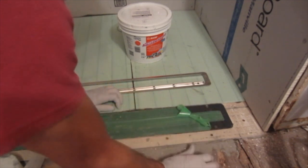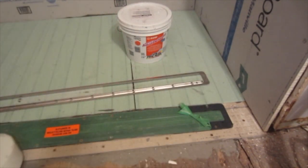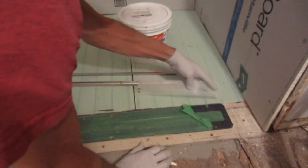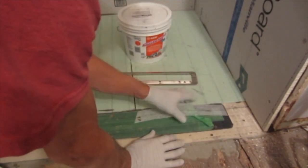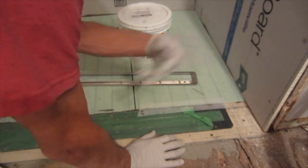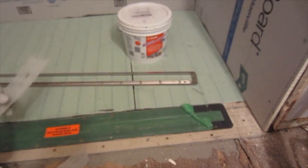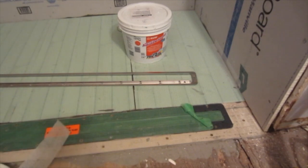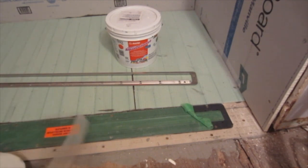On the ends here are some locating pins which go into these slots. Be careful when you're running your tape over from your membrane to here — if you are putting tape over those pins, make sure you push those pins down hard and pull them through your tape. I'll be going up to here; I don't need to tape any more than that. I'll be putting my tape on an angle and installing it to the Go Board on the sides. Typically I put the Aqua Defense down, put the tape on, go over it again with your roller. I like using a foam roller for this and I keep the foam roller in the bucket — it stays soft all the time, so I'm not buying new ones all the time.